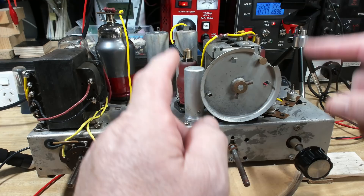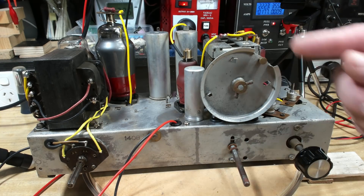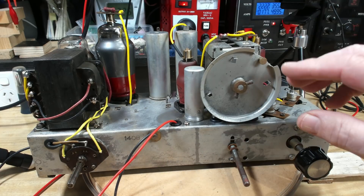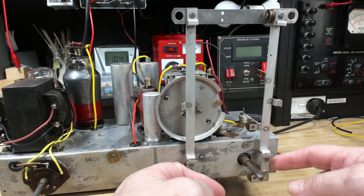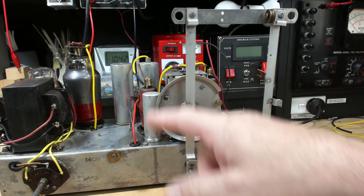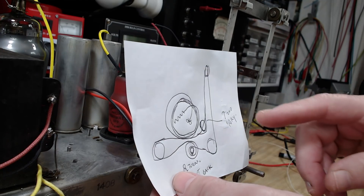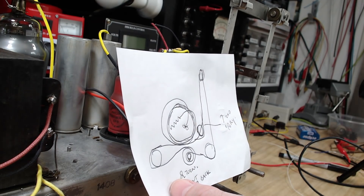The only other things I've got to do are put the dial backing plate back on, restring the dial, and fit the dial pointer. We're getting a new dial glass, but I can use the old one to line up the stations — and that'll be about it for the chassis. Time to put the string on. I've already mounted the little frame with some of the pulleys on it. I thought I had the dial string layout in the schematics, but it's not there, so I spent several hours constructing a drawing that clearly shows how it all works.